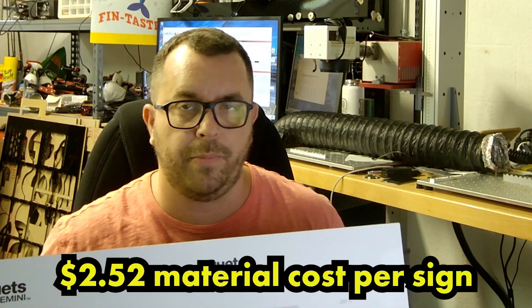The customer wants a three by 12 sign. So 36 square inches times $0.07 equals $2.52 per sign for material. Basically, if you're going to make a mass run, materials would be $2.50 per sign. Then you take that and multiply it by three, which would be $7.50. Then take the $7.50 and add your runtime and setup costs, which will vary for each shop.